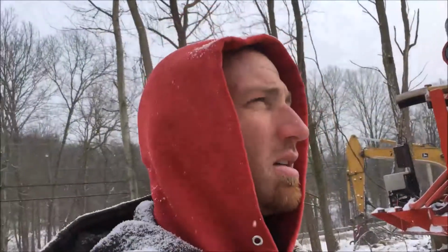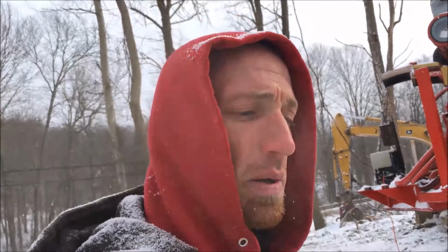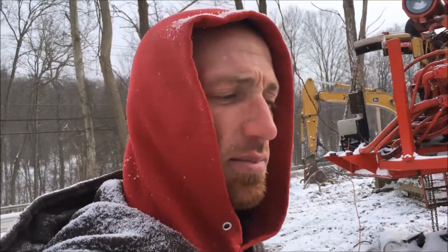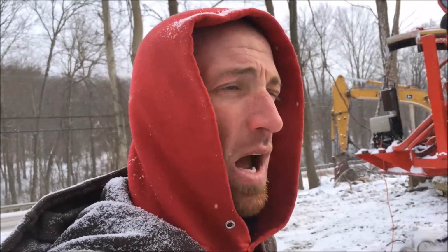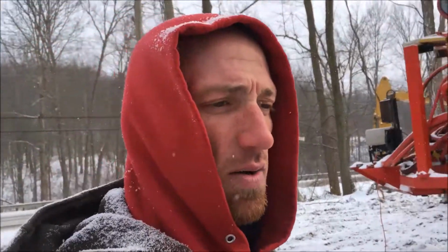To be honest with you, on the job I did this summer I was cutting a big white oak. It was bigger timber. I started using the 395, and I haven't really been using the 372 except to buck logs and stuff. It works fine. I'm very happy with it. If you're cutting timber that's 18-inch breast height and under, I think that's the way to go. You can run a 2-foot bar on it, man, you can just lay it to it. Good for bucking logs, a nice saw.